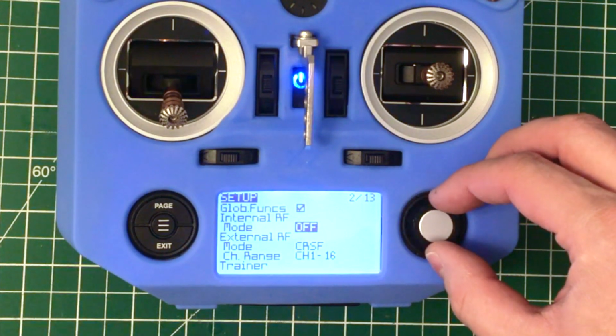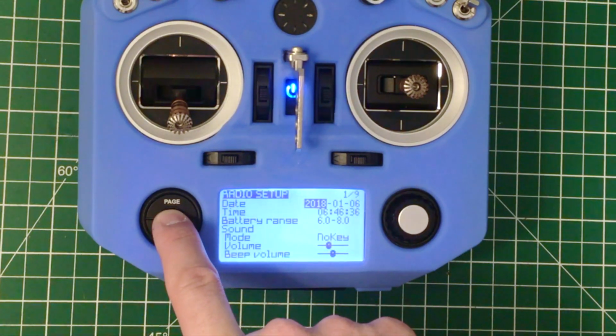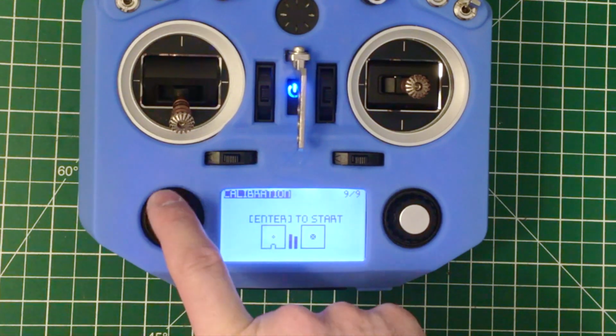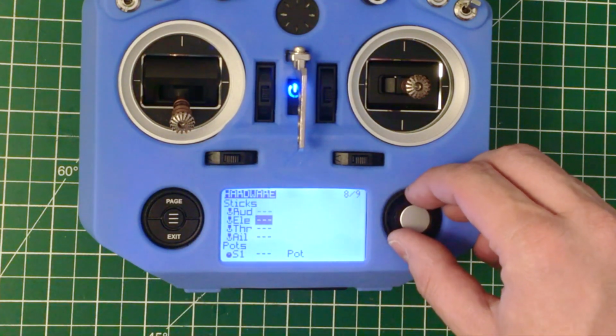protocol. There's a known issue with the QX7 and Crossfire. The workaround is either to do a hardware mod or to decrease your baud rate. Without it, you'll get constant telemetry warnings. Stinger Swarm did a really good video on this, which I will link in the description.